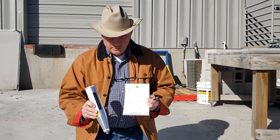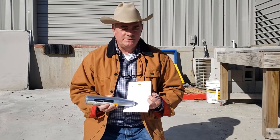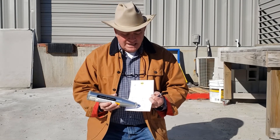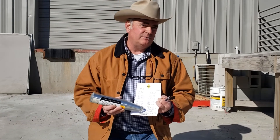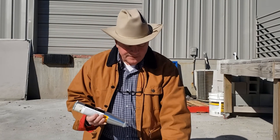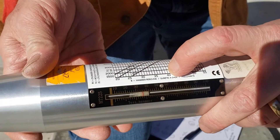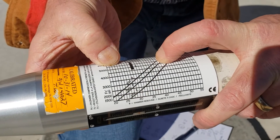So we took our 10 readings in the circle and came up with 39.2 as the average of 10. Nothing was outside of 6, so nothing gets discarded. Now, trying to split that little hair — you could call it 5,450 PSI, but ASTM C805 says round up to the next whole number. So that would be 40, and 40 on the chart is 5,500 PSI.